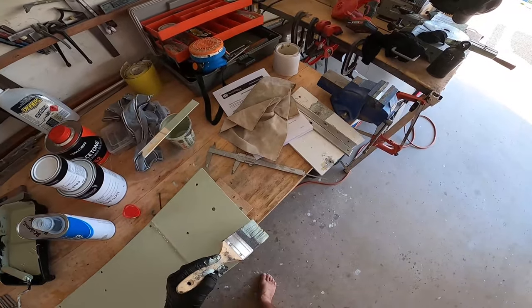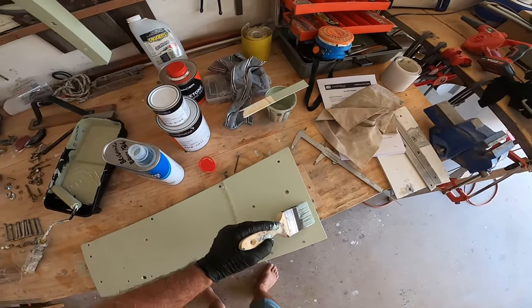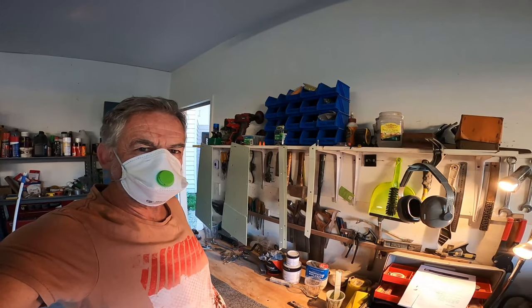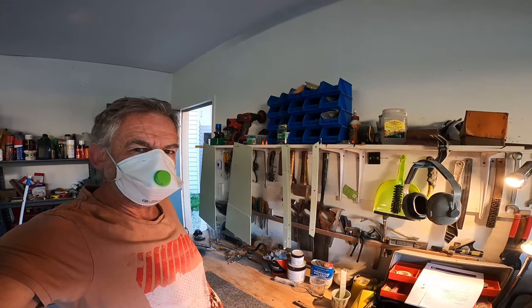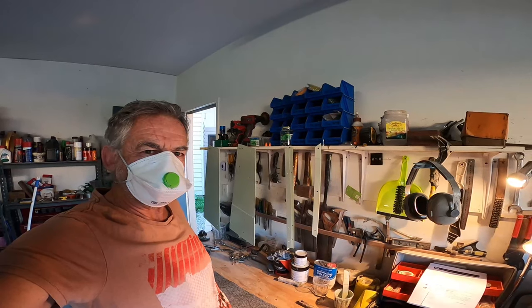As you use it in this warm climate — about 27 degrees Celsius today — the extra solvent that you've put in is flashing off. It's been 24 hours since I primed these aluminium components with a zinc-based 2-pack etching primer. I'm about to give them a light sand back and a coat with 2-pack polyurethane.